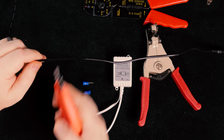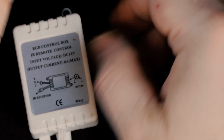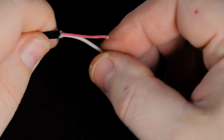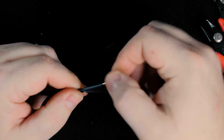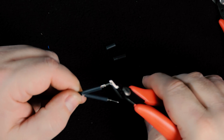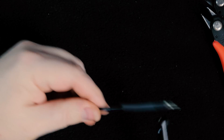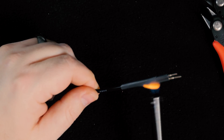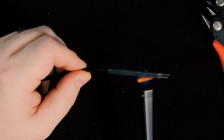To begin, cut off the connector from the 12-volt AC to DC adapter. Strip the outer shielding back — inside will be a red wire and a white wire. The red wire is positive, the white wire is negative. Put connectors on the ends of the wires you just cut and annotate which is positive and which is negative. I cut the tip off of one of the JST connectors. Secure the wire and connectors with heat shrink tubing or electrical tape — you want to make sure you won't have any bare wires in or around your board or power supply. Either way, it's dangerous.